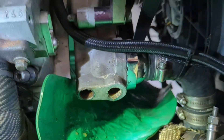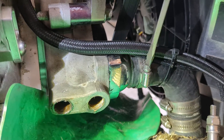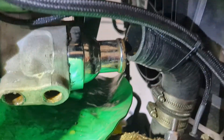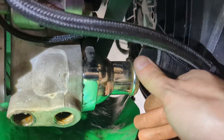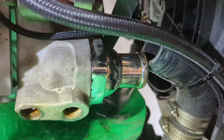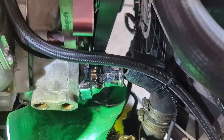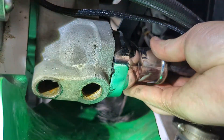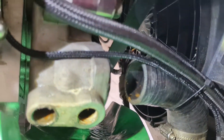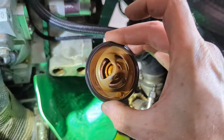This side has already been tapped, so let's go ahead and get the upper hose off. Regardless of what kind of thermostat housing you have, it should just be two bolts. I've removed those — mine has RTV on it so I'll give it a little smack with the back of the hammer. Let it finish draining out, then pull our thermostat out. I think this is just a 160-degree thermostat in there.